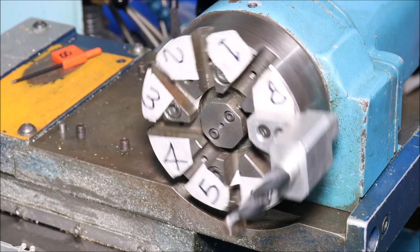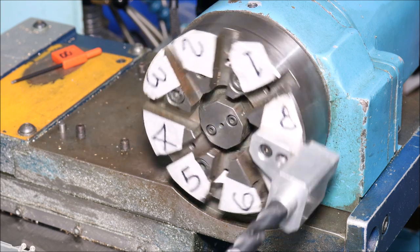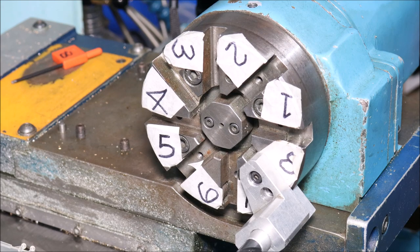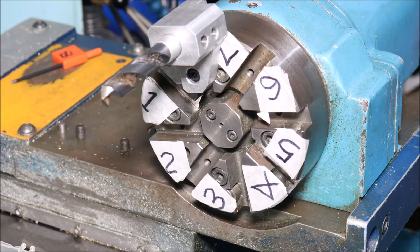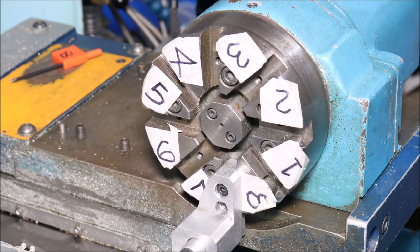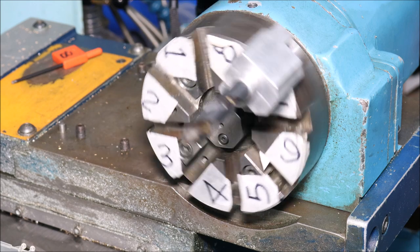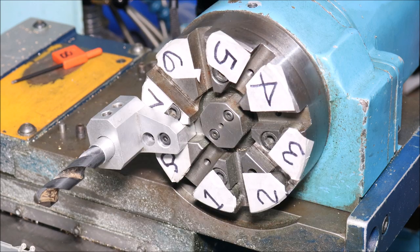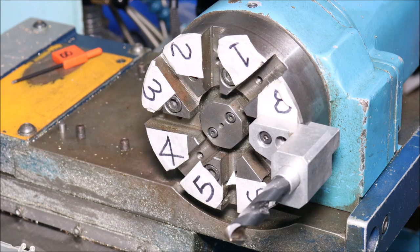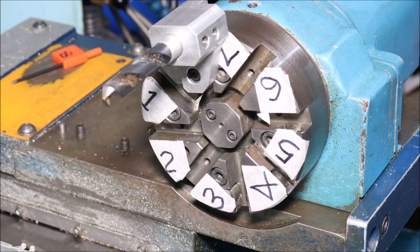Okay, let's have a look at the turret working. This is not the first test that we did - I was so confident it was working okay I actually put an out-of-balance weight on it so that we could see. I created a program that was just a program of tool changes, then created a subroutine and we ran it for about five minutes. I know you're almost asleep but hang in there - we're nearly finished. So a big thank you to Phil, my electronics friend, and thank you for watching.